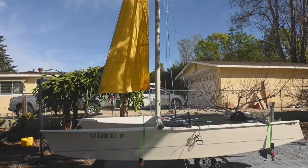One key thing, I think, if you're lowering the mast by yourself: when you disconnect the forestay from the stay adjusters where they meet the bridle wires, you want to make sure, obviously, that you've tied your jib sheet back to the forestay in the same way it was before so that you can lower the mast, but you want to make sure it's cleated. If it's not cleated, that mast could go over, which would be bad.